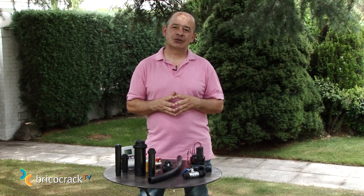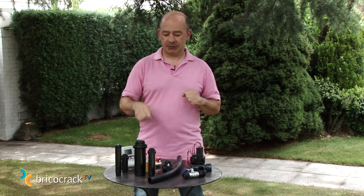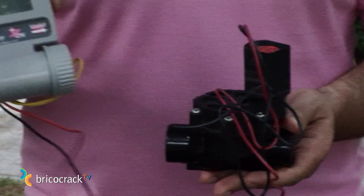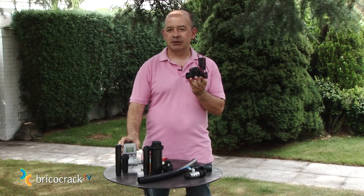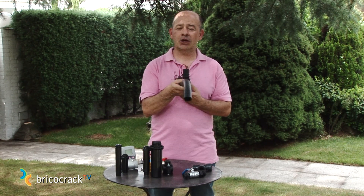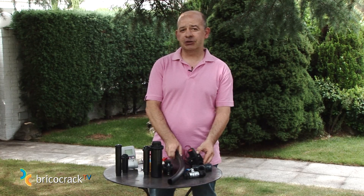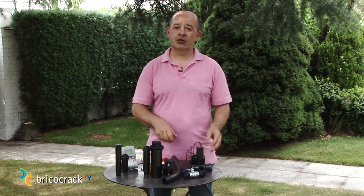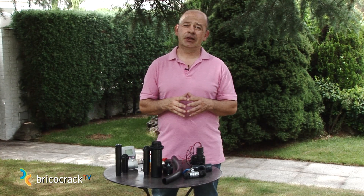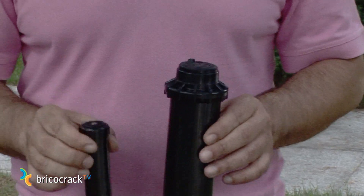The second element is automation controls. These are responsible for opening and closing the water, achieved by means of an irrigation valve connected to an irrigation controller. After automation controls, a series of pipes will send the watering to the various sprinklers through which water will come out. These emitters come in different types depending on the needs — it can be drippers or sprinklers. When it comes to sprinkling, we have rotors and nozzles, according to the size of our land plot.